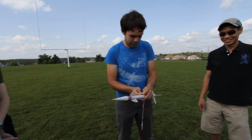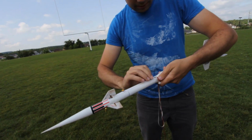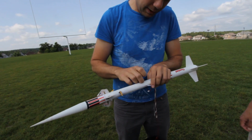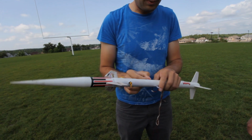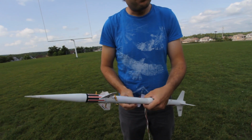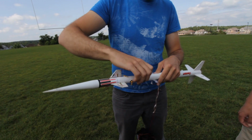So I guess I'll open it up so you can see what the internals are like. Interesting. The Patriot missile in the 80s had the same problem because of rounding errors. Really? Yeah. Well, you were dealing with a lot of that because there's no FPU on that, right? Yeah, exactly. Although the floating point stuff that they do is actually pretty good. So it's all fixed point, but they do a fancy bunch of fixed point stuff to make it somewhat standard results. It's actually surprising how well it works, and it's really slow, an order of magnitude or more. So this thing's probably maybe 60 hertz or something like that, whereas it should be like 600.